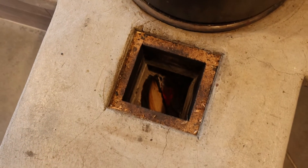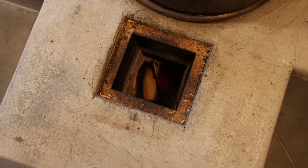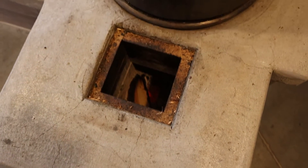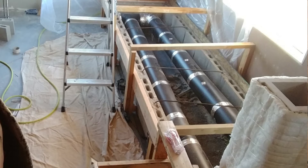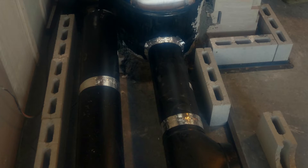That eight-inch tube goes through a mass of concrete — about two yards of concrete — and the exhaust from the fire will actually heat up that mass up to 90 to 100 degrees. That mass will let the heat out all night long. By the time the exhaust moves through the 30 feet of eight-inch pipe, it gets to a temperature of about 150 degrees, and then moves up the pipe and out of your house. You've essentially collected as much heat as possible inside the house, making your burn as efficient as possible.